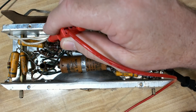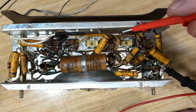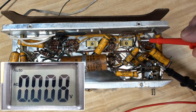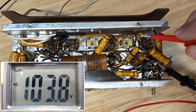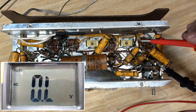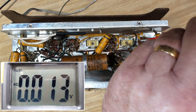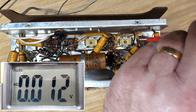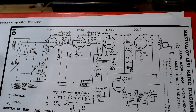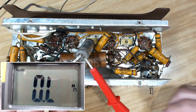I'll just check the voltages on these filaments. That's the first one - I've got 117 volts, and it goes right down here. The one next to it should be... nothing working. 117 into the filament string and nothing coming out. Just wobbling the valve there - or the tube. This should be the 50C5. It's going in on pin 4 and comes out pin 3, but it's clearly not coming out pin 3. Here's the tube - I've taken it out, and pins three and four are the filament, and it says open circuit.